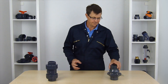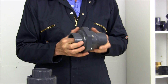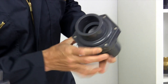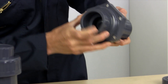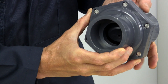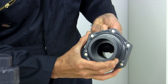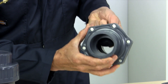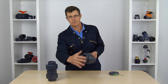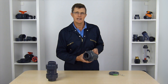Other types of non-return or check valves — this one overcomes that big friction loss. We've got a two-inch bore here. It's got a flap inside which flaps up and down. It moves really freely — there are no springs on it or metal parts. If you lift that up, it's probably about two-thirds of a full bore opening, compared to the other valves where the water had to take that tortuous route around the cone or ball. So our water is going to flow much more freely through here.